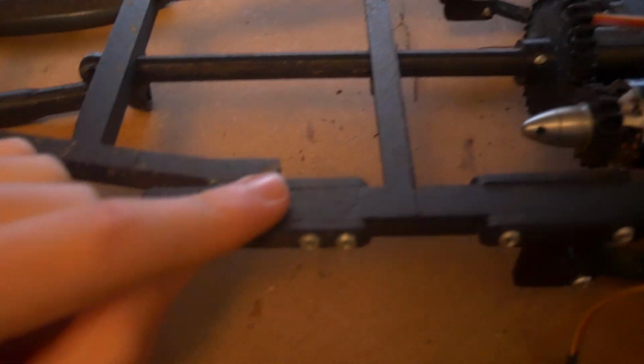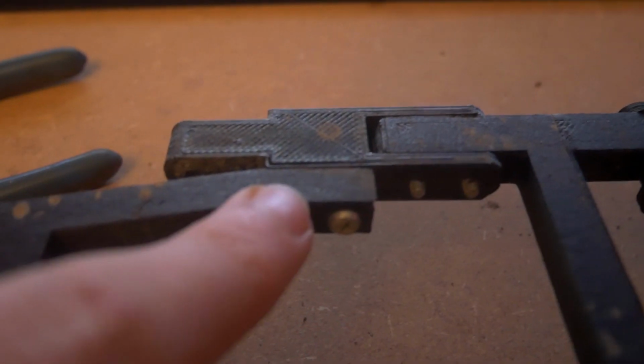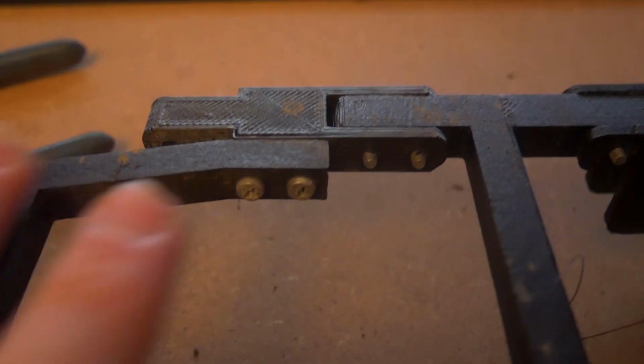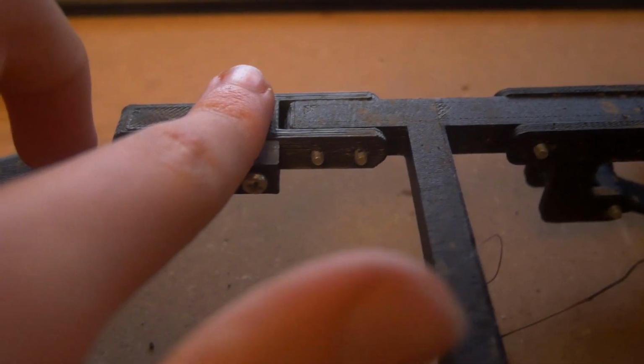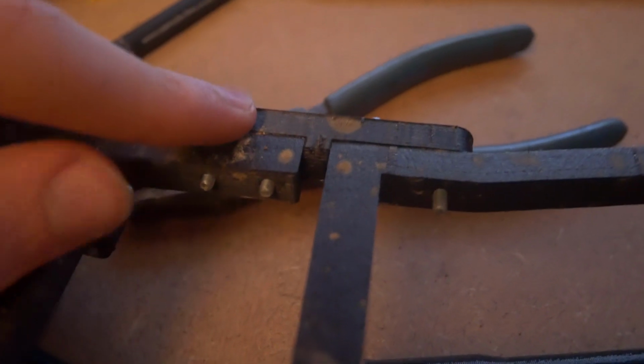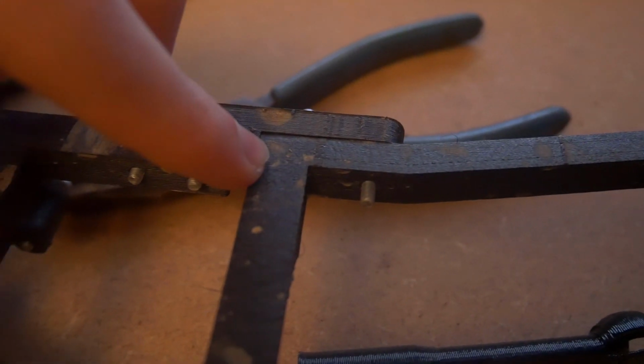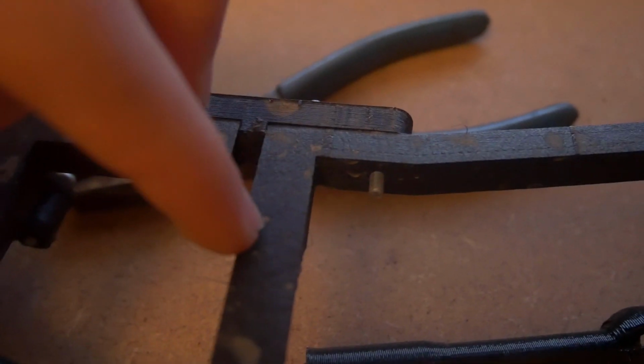So for the frame, if you've watched my other video, you have to take this piece, which goes in the end of the front piece, and it's bolted through twice. Then it's bolted through from the centre chassis piece, that bolts through into there. Moving back, take this short chassis joiner, which bolts through 4 bolts. One of the bolts is hidden inside the centre chassis.